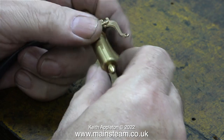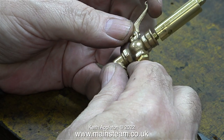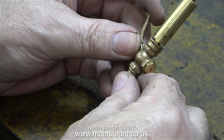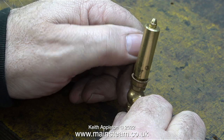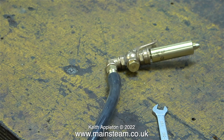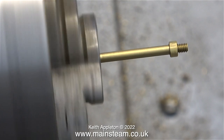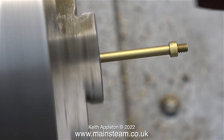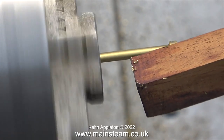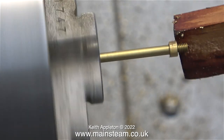I refitted the bell and adjusted it one more time, and again it was no good at all. The only time it would whistle was at very low pressure. Time to have a look at the central shaft and see how straight it is. I fitted the shaft into the chuck of my Myford ML7R lathe, and as you can see, it's spinning quite accurately. I tried to persuade it to run out of true by pressing a piece of mahogany against it, but it was perfectly fine.